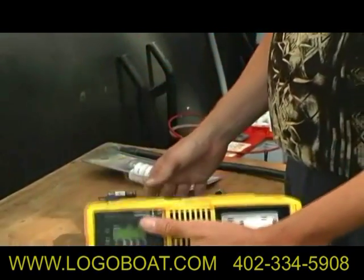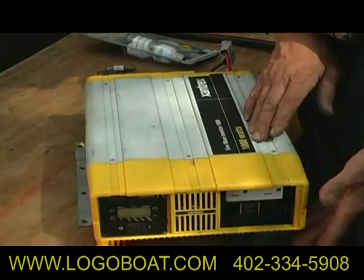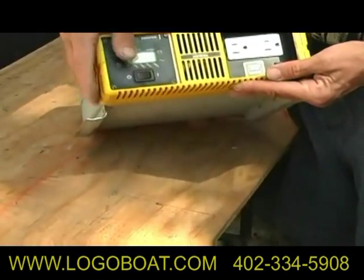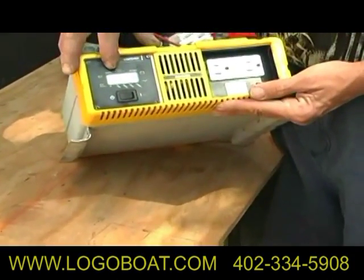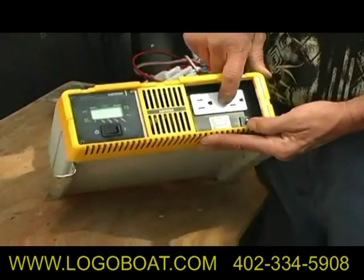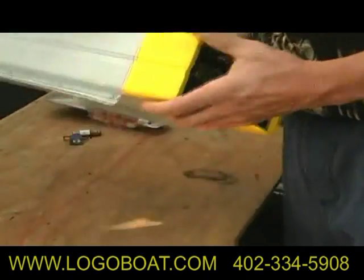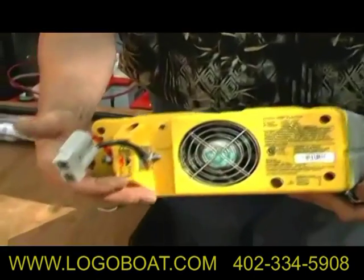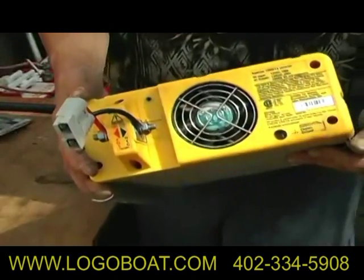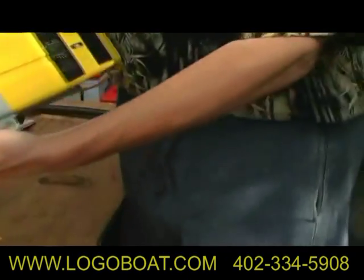Here's one of our new style sine wave inverters. This one is made by Xantrex, rated at 1,000 watts AC, which is really about 8 to 10 amps when you start drawing off of it. It's a fairly simple device — an on/off switch and a small control panel lets you know when power is coming in and how much is going out. There's also a place to plug in a standard extension cord and a small fuse in case power gets too high. On the back, we connect the battery with very obvious plus and minus terminals. Reversing polarity will damage the unit. This one also has a fan to keep the inside cool.